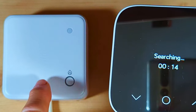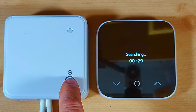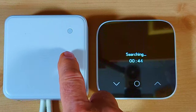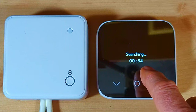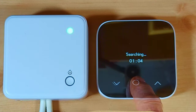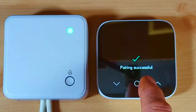Now we need to put the receiver into pairing mode too. Go back to the receiver unit and press and hold this button for 10 seconds — one, two, three, four, five, six, seven, eight, nine, ten — and then the light should change to a purpley-white color. It's flashing one second on, one second off. And any second now it's going to say 'Pairing' and the two units will be linked together. Once connected, the light on top of the receiver turns to a solid green — and there we go, solid green — and it now says 'Pairing Successful'. The thermostat is ready to use.